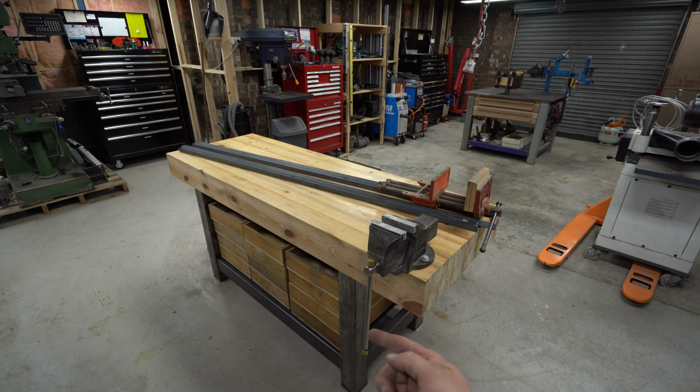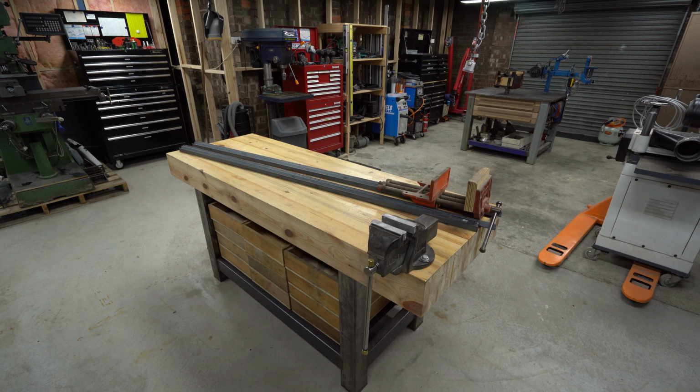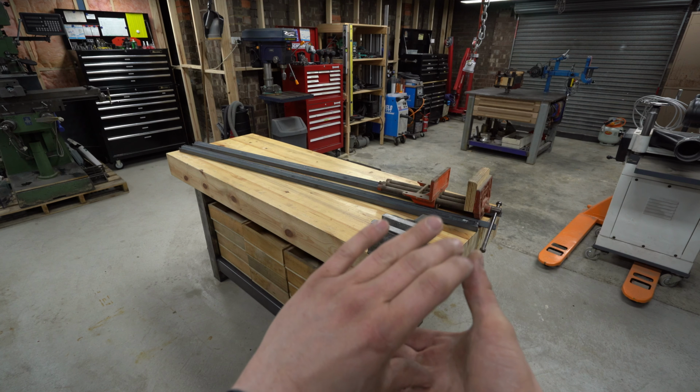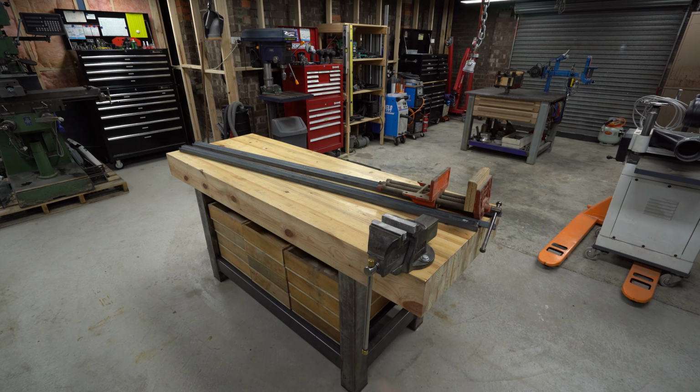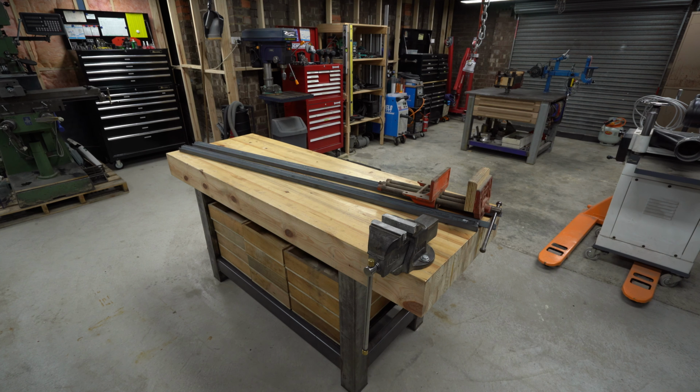All I need to do, I've got a loose bit of form ply on the bottom there, which you can just about see there, and I need to inset that into the base, these rails here, and I need to produce 3 more shelves, and that's what this 5mm steel angle is all about. I'm going to produce some shelves that are this way up with the form ply sat inside, so it's flush on top, and then these will be essentially trays on a heavy duty shelf, but they'll act as drawers. And as you can see, there's no drawer slides to bend or break, and I think it'll be a more robust solution. And all my machining materials from there will go in there. So that will be good.